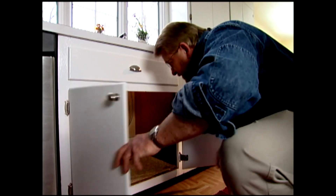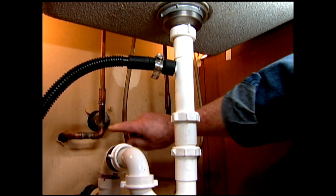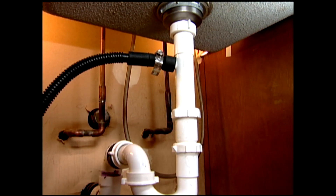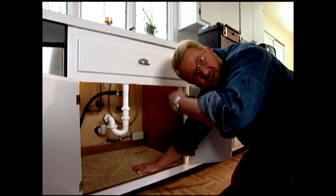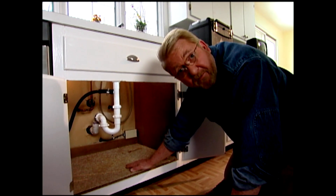There's only going to be room for one of us in here, so if you've got something you want to do, just go ahead. I sure do — I'll give you a holler if I need some help. I'll probably have to have you show me where to turn off the water for the house if it comes to that. This is my first surprise of the day. Normally, there would be shut-off valves right here so I could turn off the water supply for the sink while installing the new faucet. Since there are none, I'm probably going to have to turn off the water for the entire house.